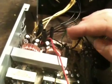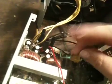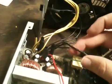Since this already had a switch on it, the green wire here switches the power supply on. All you've got to do is run it straight to a ground wire, one of the black wires. I just soldered it together and put heat shrink on it. That way, when I flip the power supply on, it will come on automatically without needing a separate switch.